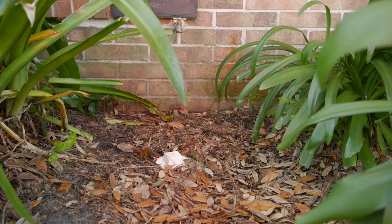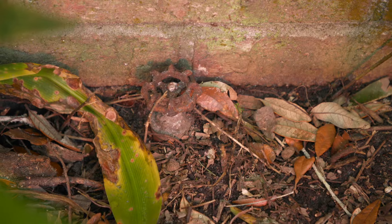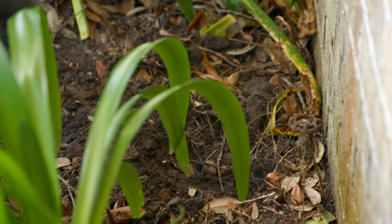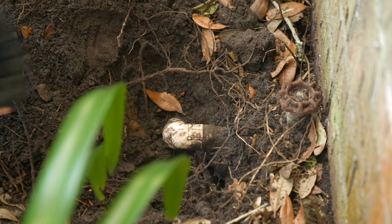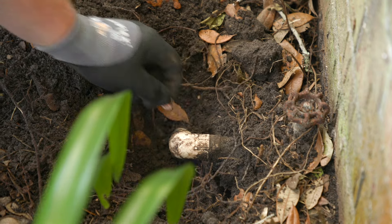The next step is to find the connection near your house where water enters your home. Dig down carefully with a small hand shovel so you don't damage anything. In this case the pipe was easily identifiable as PVC, but we still tested it with the magnet — it didn't stick. We scraped it with the penny too — no shiny silver color, which would show signs of lead.